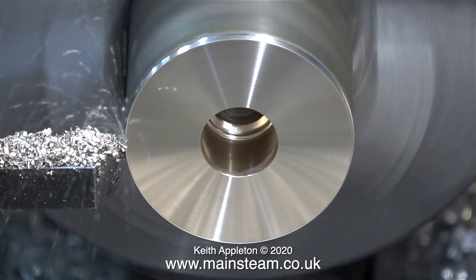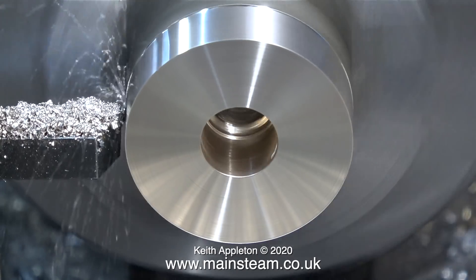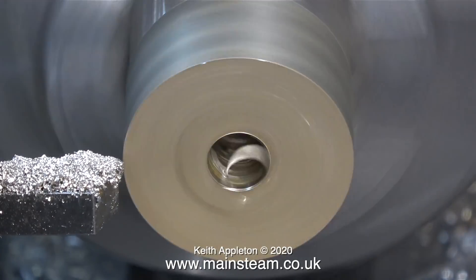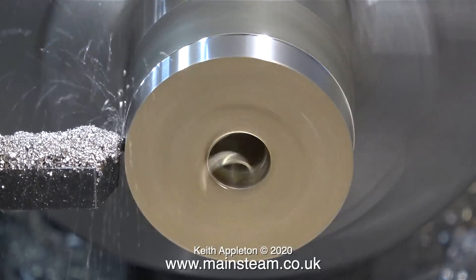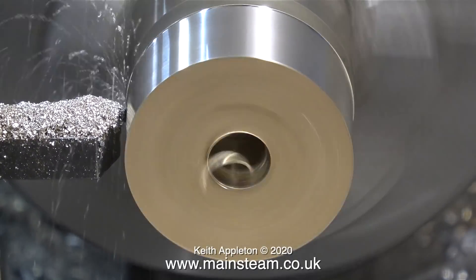This piece of metal I'm working on in the first place is a chucking piece — what was left of a long piece of bar turned in a lathe, much larger than this, in some industrial application. In this clip I've turned the part round to machine the other side. I haven't adjusted the position of the cutting tool, so it should more or less turn the same diameter, although for this job that is not all that important.